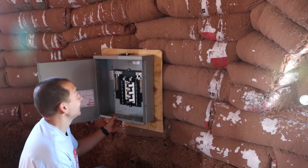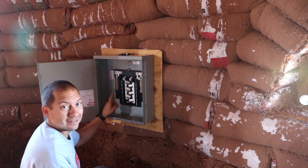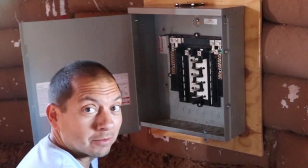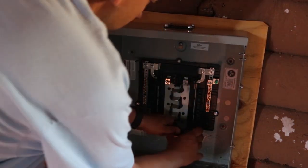All the stuff for the outlets, the switch, and the lighting. I think everything is good on the ground floor, and I might want to add one more receptacle like this up into the loft, but otherwise everything is good to go. I think I'm going to start stringing the wire around now. Unfortunately, I still don't have a lot of the things I need out here. I don't have any of the conduit I need. I still need some 50 amp breakers. I'll just start with what I can. Put these in place, start doing some of the knockouts, and maybe start stringing the wire around.